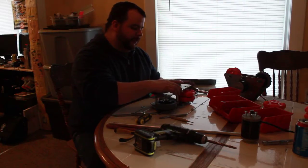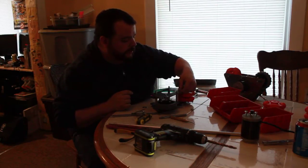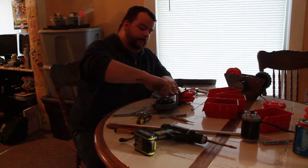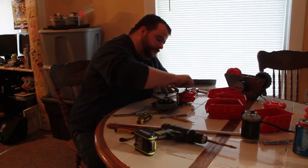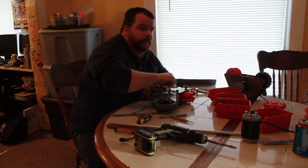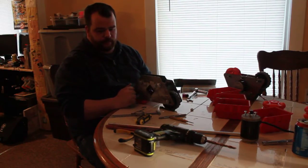So I didn't have washers on any of the parts in the inside. It doesn't need them. The spacers are holding them in place, so we don't have to worry about that. So washer on that side, all 5 of these. And then we take our nylock nuts. Let's get them up to where the nylon insert is. Get these containers really neat. Now that that's done, it'll hold itself together just enough so we can start tightening some bolts.